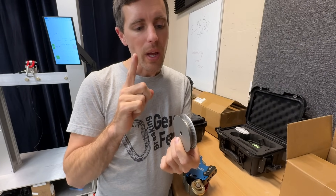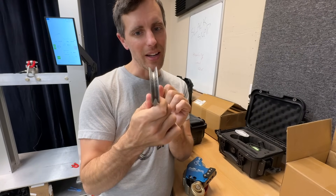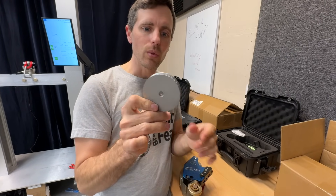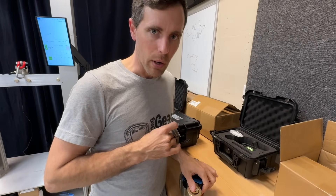We have a wheel here that works for 11 millimeter to half inch rope — 12.7 millimeters. Arborists have been very interested in having one of these work on the ropes they want to use. We actually had some people here who asked would it work on 8 millimeter, and I said I can make you a wheel. I like that as an option. It's a pretty cool collaborative effort put into these drill-powered pulleys.